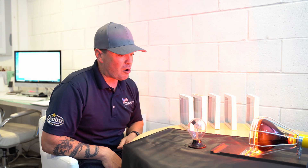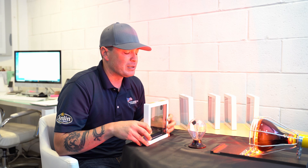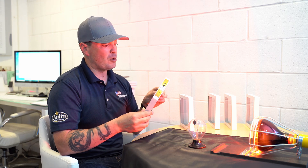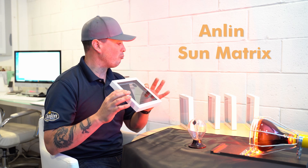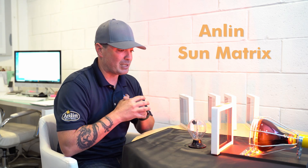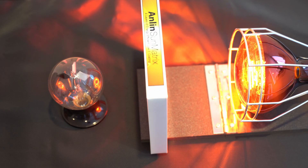As we pull it away you can already see it starts to spin again. For people that have a lot of windows on the west or south face of your house, I would go with four layers of low-E. This one I'm holding here is from Anlin Windows and they call it the Sun Matrix — four layers of low-E. This has an even higher rate of performance. This is going to block about 81% of heat gain from the sun itself — with a solar heat gain coefficient of 0.19. This will actually make this thing stop, and for a longer period of time — probably an hour and a half to two hours before that heat starts getting through.